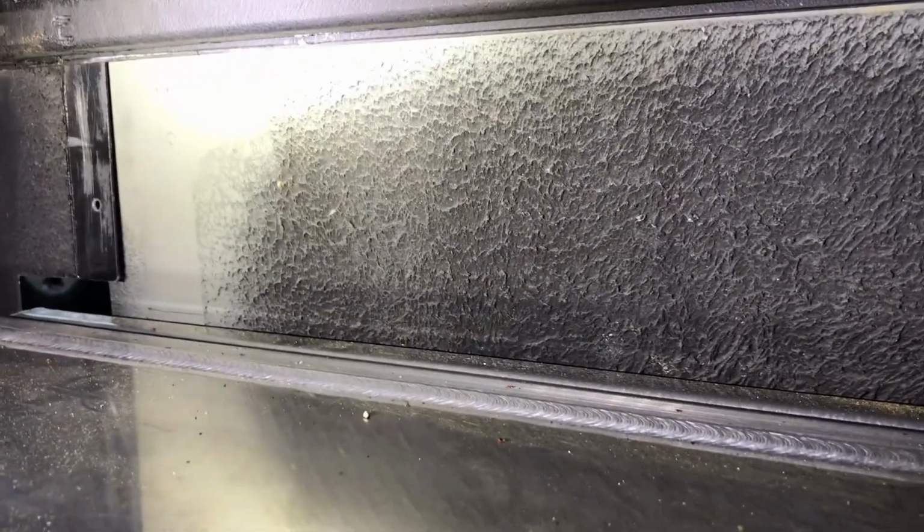So now I got to crawl out from under here. I'm going to take the sheet metal back off again, and we're going to put a scratch. I guess that's what I'm looking for right there, now that I think about it. I also put a scratch right at the edge of this metal on that. So the difference between that scratch and that scratch is going to be this space that I'm leaving right here, which is still actually adjustable. I could make this space right here wider if I want to, and I might, because I think I measured it and it's within a few, like 30 thousandths, which is like a 32nd of an inch from the side.